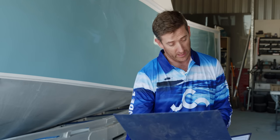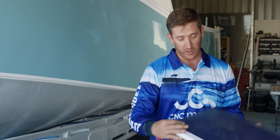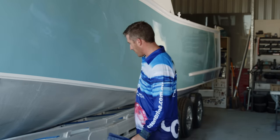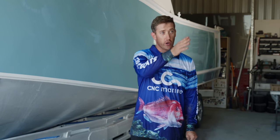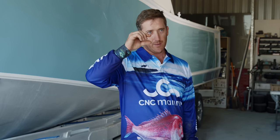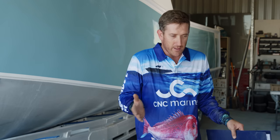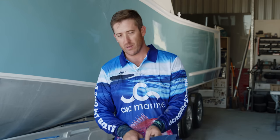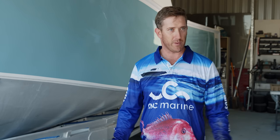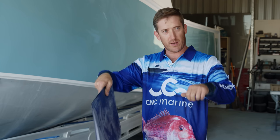One little thing I had trouble with: I didn't realise the hull isn't flat — the surfaces at the back aren't flat, the whole thing has a curve in it. So when I got out to the end there was a little bit of a gap, and trying to work out how I was going to pull it up was challenging — with 6mm you can't just pull it with your hands and tack it in place. I worked it out in the end: just got a ratchet strap and pulled each individual piece up to the frame to keep that curve that was in the design.